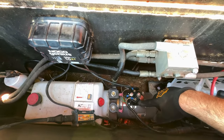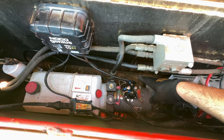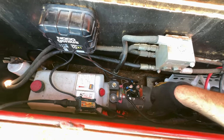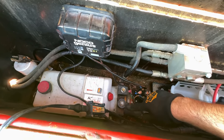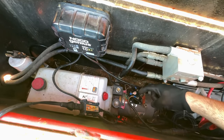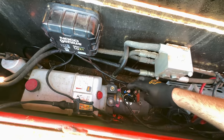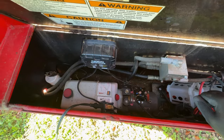Ground is right here, power is right here. The way this works: this is kind of like a relay solenoid. When you're not operating the pump, there's essentially no power coming from the solenoid to the pump itself. This is a power bus bar, and your ground is always connected directly to the battery. Power comes in from the battery here, and when you press the button it connects the two together so power passes through while also triggering the correct valve. This valve extends and this valve retracts. All it does is allow a small wire from the remote to control a large amount of power — it acts like a wall switch. Just two bolts holding it on from the bottom and we should be able to remove the whole pump assembly.